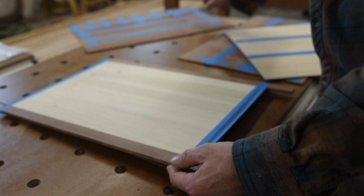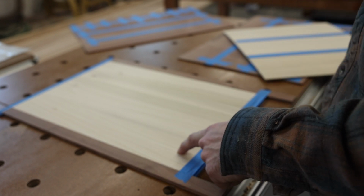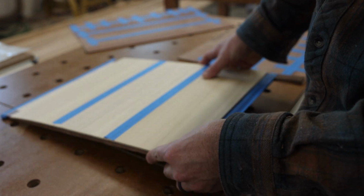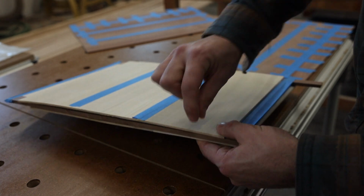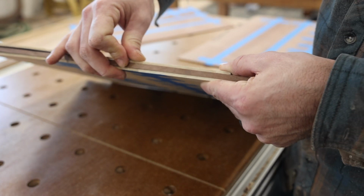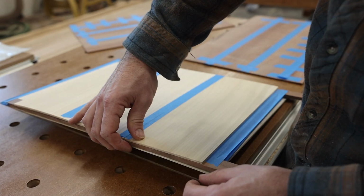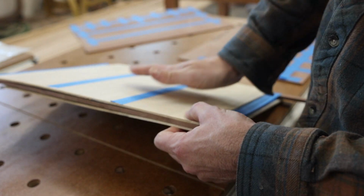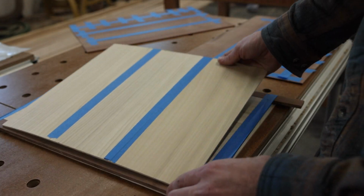What I did wrong on the lumber core was actually make the walnut the same thickness as the center core, forgetting about the fact that I have cross banding on both sides. So with cross banding on both sides, you go to the edge, even though my veneer goes on the outside, you're still going to see this poplar layer. So for this one, it's all right because it's a literal test panel, but the fix would be actually cutting a piece of walnut as thick as this sandwich, then veneering over that edge piece, giving you a walnut veneer all the way around the edge.